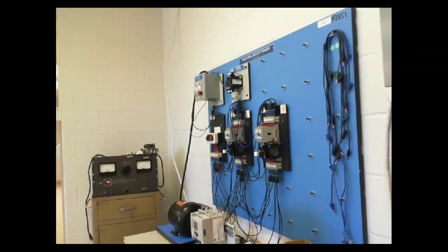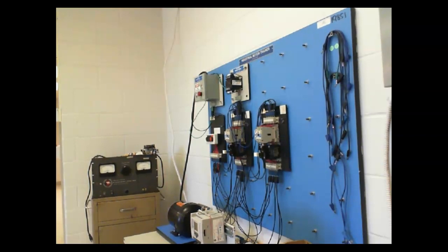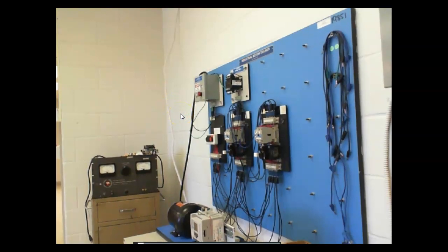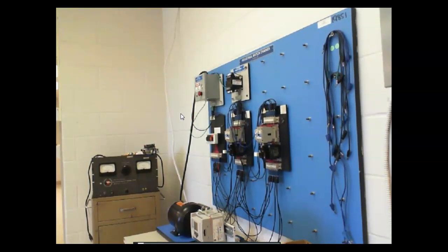And notice I didn't have to line it up. I could actually get out a little bit to get it to go past the relays. And I got all the way back over here. These guys right here are, I think, 5 or 6 feet. So I was a good 8 feet away, and this thing was still working. But the through-beam has the ability to have the longest range because it doesn't reflect back off anything. It just goes from transmitter to receiver.